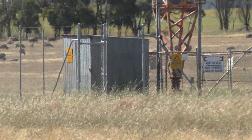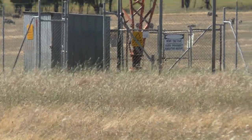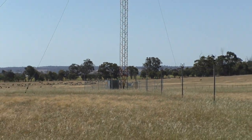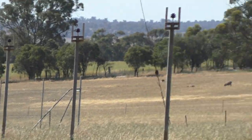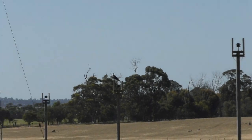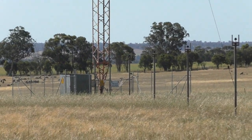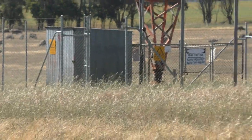There's got to be an insulator at the bottom of that. There are no skirt wires going up it, so it's not a folded unipole type antenna — it's going to be fed from the base. The old open wire feeders going all the way down are probably a bit of history now, because there will just be coax under the ground going all the way over to the ATU.